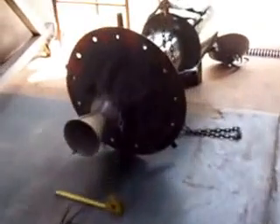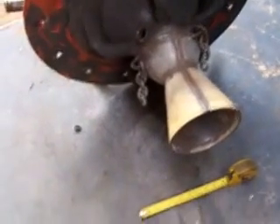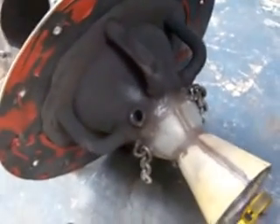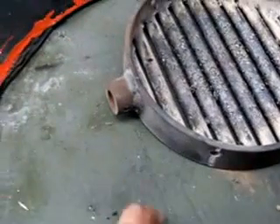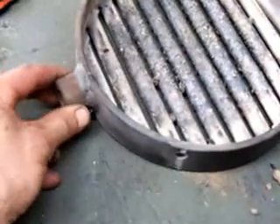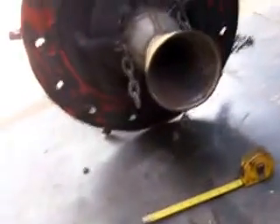I've taken the top section out and what you'll see here is this Imbert cone pin that I've adopted off the PowerLabs website, which I'm going to change. Now this over here is the ash grate, and the pin goes into the side of this. There's a half-inch pin that goes in here and shakes it back and forth. That hangs off with stainless steel shackles off these chains here.